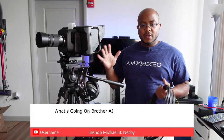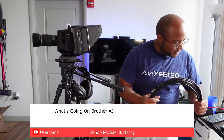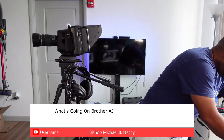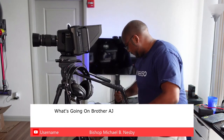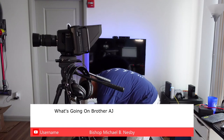The other thing is I'm excited because this is the rig that I wanted to build out. This is a rolling tripod, a Magnus kind of rolling tripod that has wheels on here. It has the extra arm because the other piece that has not come in yet is the remote zoom in and out controls as well as the fine focus knob, which I have on order. So that I can move around, I have an SDI to HDMI converter here that I am going to plug in. And then I also have a bidirectional HDMI to SDI converter on the floor, which is going to be coming from the camera. So that's SDI out.